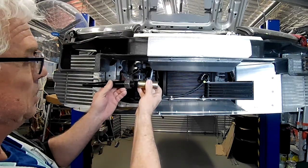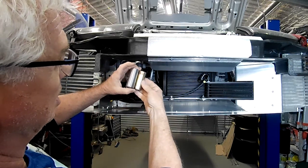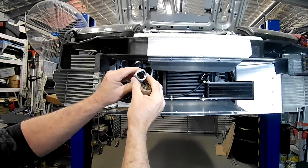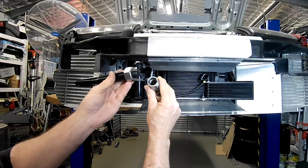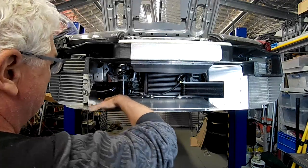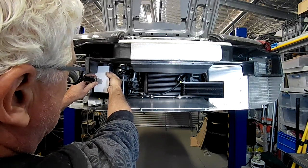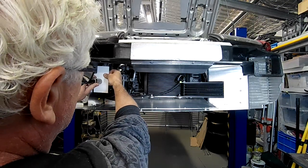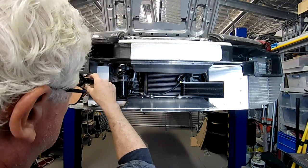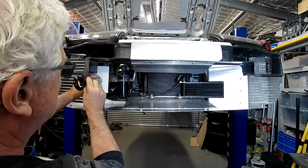The spacer needs to slide inside to then weld onto this nut. So what I've done is put one on the mini lathe and turned all of the plating off it so it'll be easy to weld. I put a bevel on each end so that gives me something to weld into, and I've machined a section out so that the remaining thread on this slides down into there. Then I'm going to weld that together, have a piece of 6mm plate on here, weld this on somewhere there, and then put some gussets running back down onto this with bolt holes and bolts. Just have a hole drilled through the front bar and that should allow it to go in really easily. I just thought I'd show you that before I go too much further.